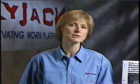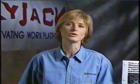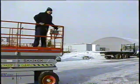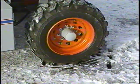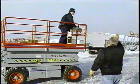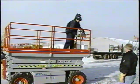Even when using lift equipment on firm level ground, care must be taken to ensure that the surface under the aerial device is capable of supporting the total weight of the machine, including its rated load. Operation of a work platform while positioned on top of access covers, drains, trenches, or other unsupported surfaces is not allowed, unless approved by a site engineer.